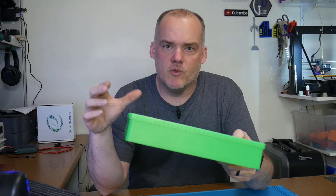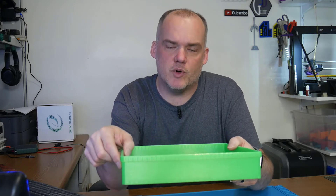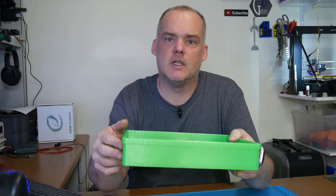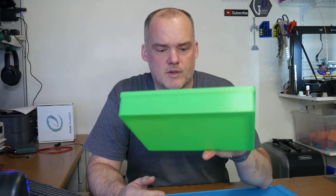It's really not that big. I'm using a 0.6 nozzle. The monster should really print faster than that. A little bit of the reason why it took so long is that it's very thin, which means the outside perimeters were most of what it was printing. But I got the D9 to print big stuff — that's why I got the monster in the first place. So today I'm going to mess with the speed settings on the D9 monster and try to make something like this take less time.